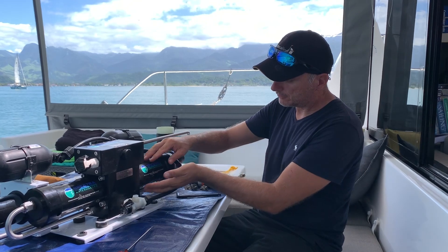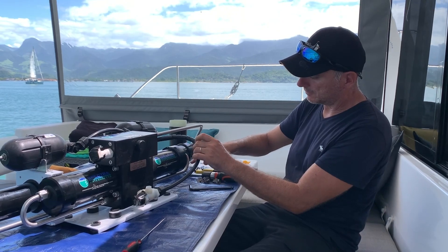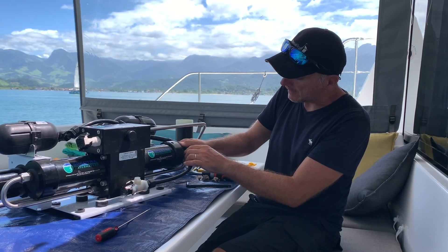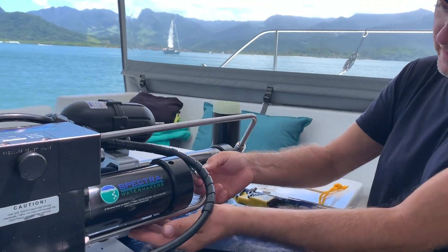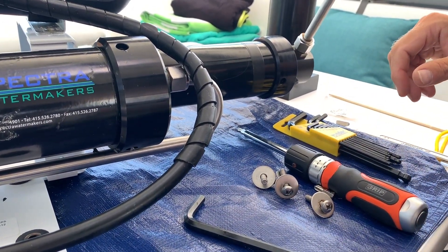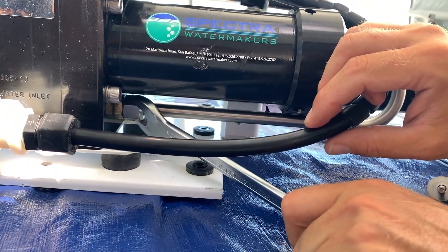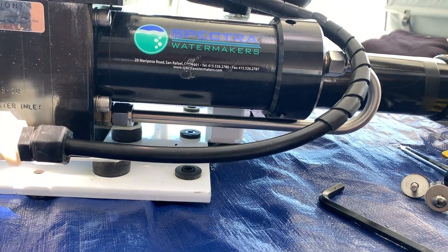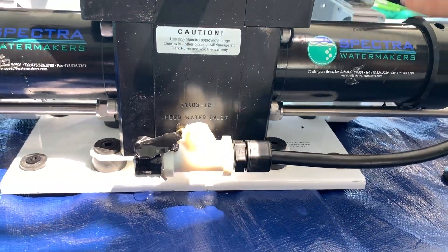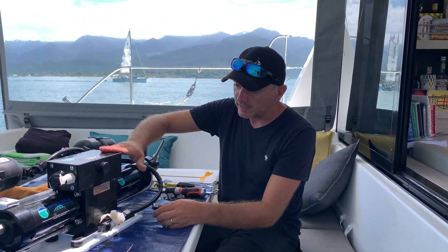What I have to do is remove this cylinder, but here you have this J-tube. There is no way for me to unscrew this without unscrewing that, and there is literally no space to work with a wrench — no space at all. Because of this I need to take everything apart: take these four screws out and open these just to be able to remove this end cap.